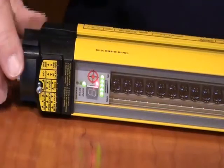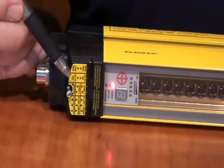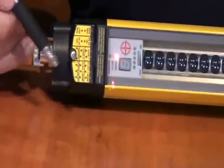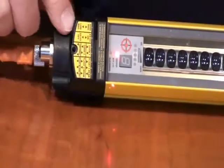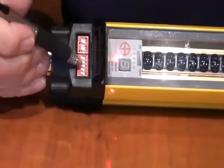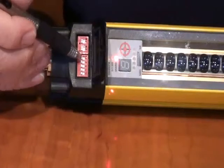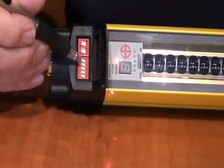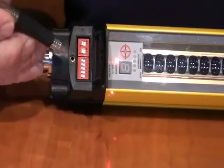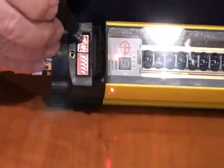In the close-up here, we have dip switch selection for some of the features of the light curtain. It has floating blanking as an option — one beam and two beam floating blanking — and that is configured by raising the lid here, where you can see the dip switches. Very simple to configure. Other switches are used for beam coding, which is used if you have light curtains very close together and there's a possibility of them cross-talking with each other. Instead of having to purchase a separate part number to eliminate that problem, we can just change the dip switch settings. There's also a setting for changing the range — short range or long range.